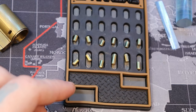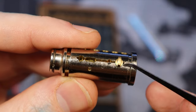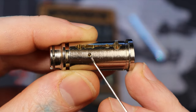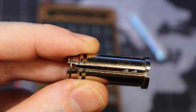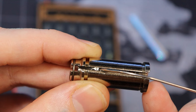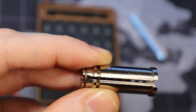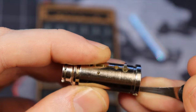So there we go — you can see that all the pins are standard. Here is our bitting. All right, let's see if I can demonstrate how this check pin works. The bar right here that holds that pin in is held in by a little brass pin right here, and the spring that moves this up and down is right there. There's a little brass pin holding that entire bar in there — that's how that works. If we look underneath, it's a little hard to see, so let's look in the back. There we go, nice bright setting right where my light is shining. See that little bitty nub right there — that is the pin we have to lift up in order for this to go down.